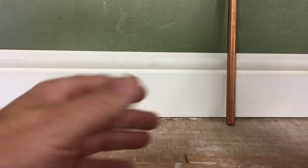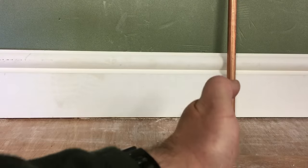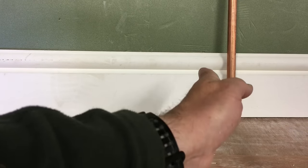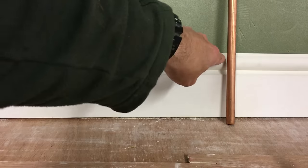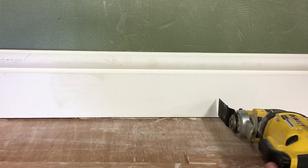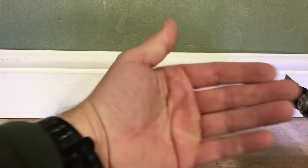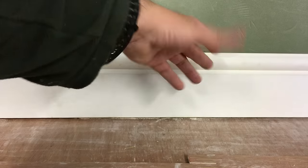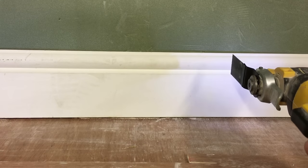While I've got this set up, another thing you can do with skirting boards: say this pipe represents the side of a kitchen unit or a vanity unit going in against the skirting board. Without having to take the skirting board off, you mark a line down the skirting board and then just cut it in situ — cut straight up there, remove that piece, and put your unit in. It's effectively a plunge saw; you're plunging in and cutting without the need to remove any trim.